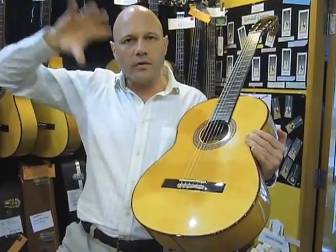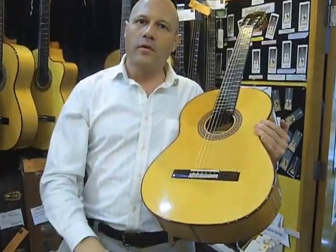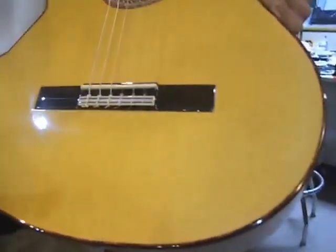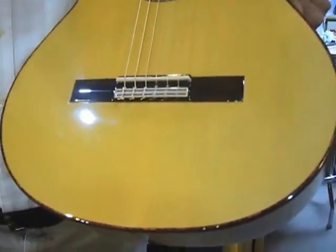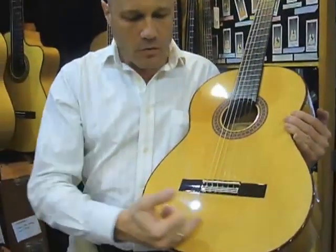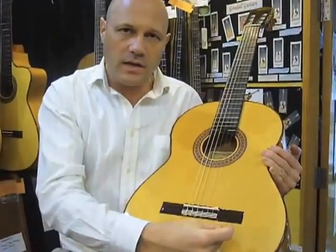It's a very cold area, so the growth is very slow. When it's wide-grained, the trees are growing lower near the river, so that's a wider grain — that's more for low-priced guitars. That's one of the main issues, and that's how you tell when you look at it. When you select the woods for a guitar — classical cedar or spruce — the most important is the grain, how the tree has been grown, because the top is a two-piece when we glue it together.